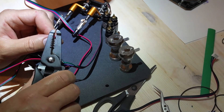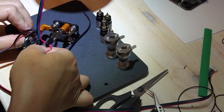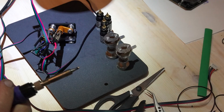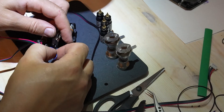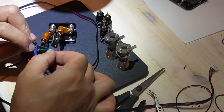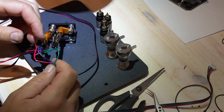To solve this, I had to swap one coil connection on one of the motors. That reversed its direction and then both motors moved together in sync. This is a common issue when two motors drive the same axis from opposite sides. Always test movement and don't rely on wire colors alone — wiring may need to be adjusted depending on how the gantry is set up.